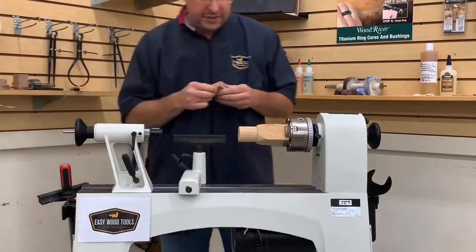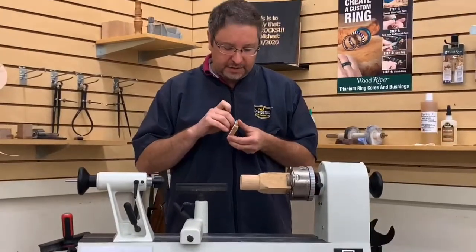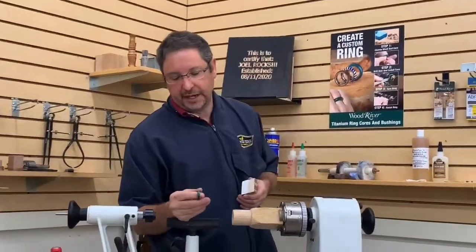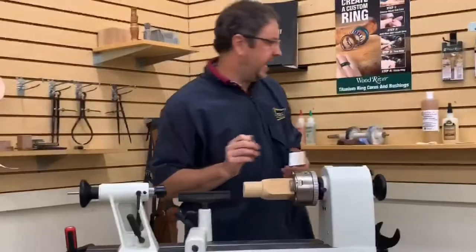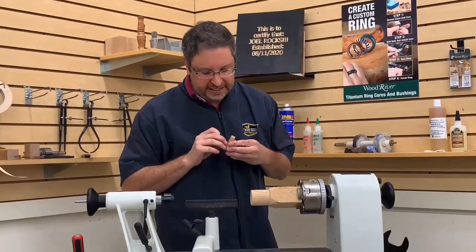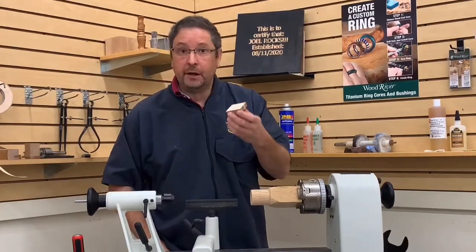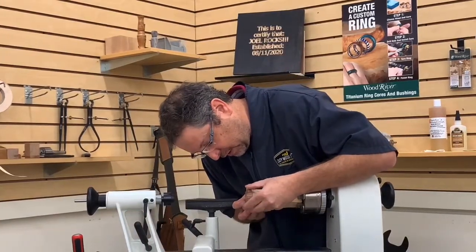Other things that you can do, I'm using wood. Before I started this demo, so I could practice for this demo, I used True Stone. That is a different material that you can purchase elsewhere. It is part 85% pulverized stone and 15% acrylic. You can turn it with standard tools, and it is beautiful. Other things we can make rings out of would be acrylic, antler, and anything else you can think of that is turnable, you can do.